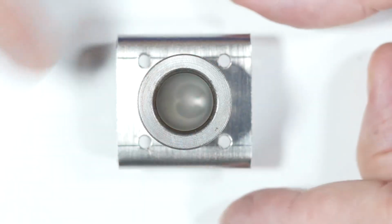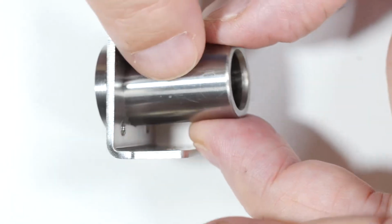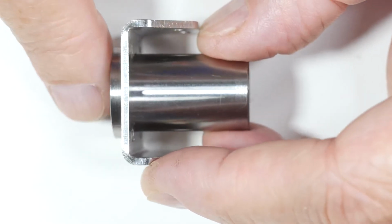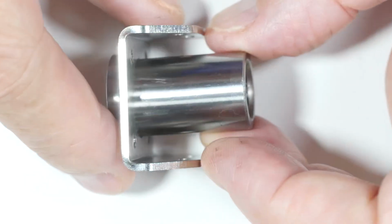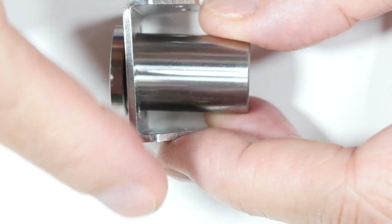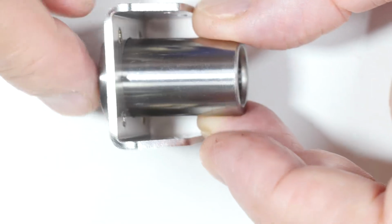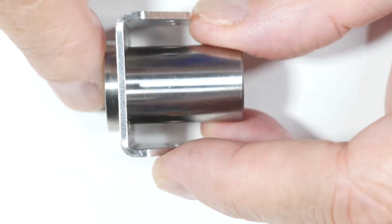Yeah, so I don't know, maybe I will try to do something. I don't have a machine shop, which would be ideal, but try to figure out some kind of a water jacket. At the speed at which the water boils in this thing, my worry is that if I wrap copper tubing around here, the water in there would flash boil and come shooting out into somebody's face or whatever. But yeah, this is the number one reason it doesn't work. There are other products on the internet that have huge heat sinks, like down in here. And yeah, if I had a machine shop and whatever, I would machine something like this, much thinner steel, pressed into a block of aluminum, maybe with water cooling or just a lot of air fins on it.